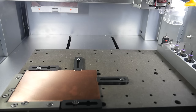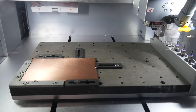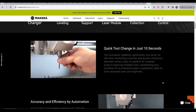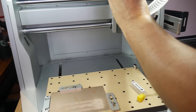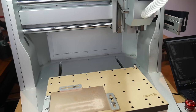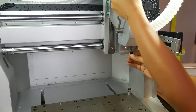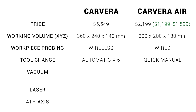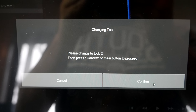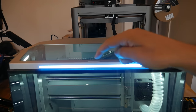One area that's quite different is the lack of automatic tool changing present on the Carvera, where we can load up six tools for the machine to switch automatically between throughout the job. The Carvera Air instead has a manual change, but promises that it's quick and can be conducted in under 10 seconds. And I would say that is absolutely spot on — we pull down the lever, which opens the jaws, and we can then pull out the old cutter and repeat the process to put in the new one. As an experiment, I called over my 10-year-old, explained it to him, and he nailed it first go. It speaks to how simple and intuitive this process is, especially compared to a typical spindle which requires two spanners to rotate a nut and tighten a collet. So still easy to use, but we don't have the convenience of setting up up to six tools before a job starts. When there is such a tool change, the machine will pause and prompt you to put in the next tool, and once you've done this, you can hit okay in the software or press the physical button on top of the machine to continue the job.